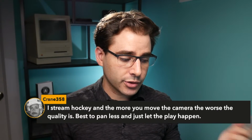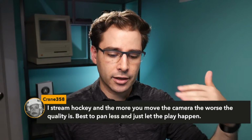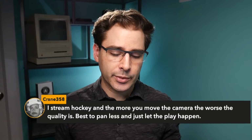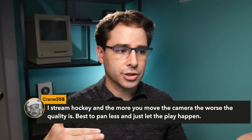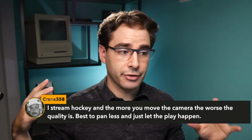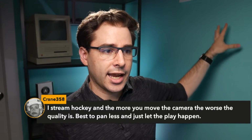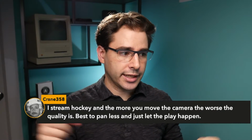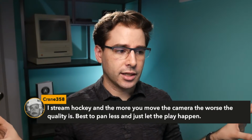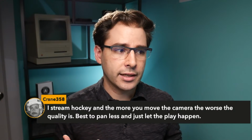If you are streaming, the ATEM is trying to keep you at around whatever your data rate is. Right now I'm streaming at 6 megabits, but it's not constant bit rate. It does change. If I switch over to my computer screen, where there's very little changing, here there's a little bit of noise, right? It's kind of fuzz because it's still a camera sensor. But when it's a computer screen, or this text, it's 100% not changing, so a very low bit rate is required to encode that.